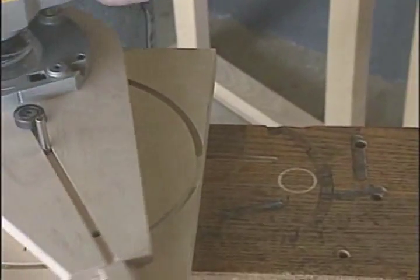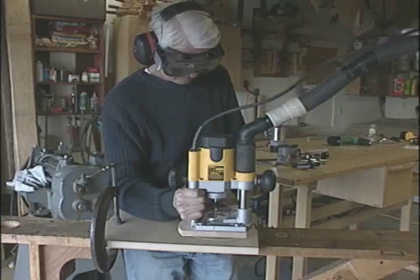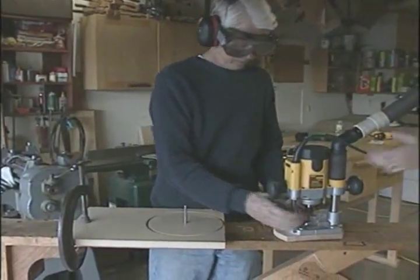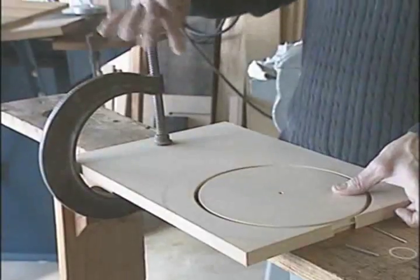If you only need one template for a circle and not a hole, let the cutter pop through the edge for inspection. If you do this correctly, you should be leaving a thin uncut web of the disc which will continue to hold it in the blank. Cutting entirely through it would cause the disc to slam against the cutter when it frees itself and just spoil everything.